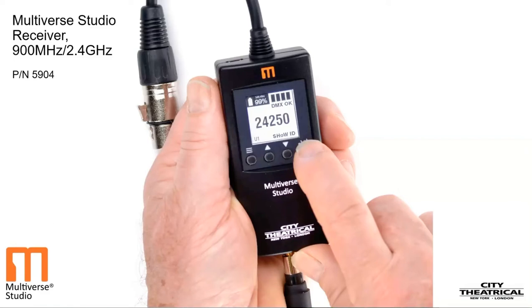The first, a lithium-ion polymer battery with 20-hour battery life. Note that the battery life is largely dependent on the backlight of the user interface screen, and the 20-hour figure is at the default backlight setting of 70% on all the time. Battery life can be extended beyond 20 hours by using the backlight timeout feature or setting the backlight to a lower level. It is in an IP61 rated plastic case, making it splashproof and rainproof, but not for permanent outdoor use. It has a rugged, stubby, dual-band omnidirectional antenna, and there are other antennas that are available for other uses.